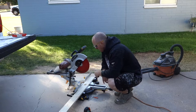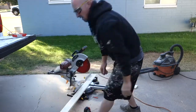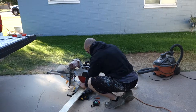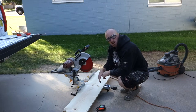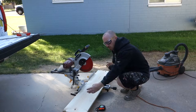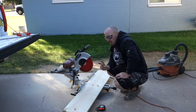We'll first start by cutting our 10-inch wine holders. Next up is our 1 by 12, which is actually just 11 and a quarter inches wide. That's why you can still do it on this table saw or miter saw with one cut. We're actually going to do 20 inches — we have a 4-foot board, so we're going to get two out of each piece.